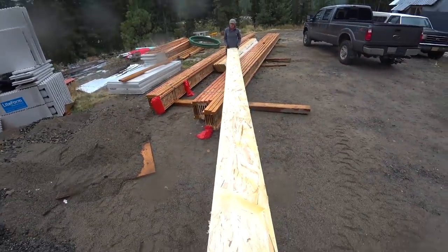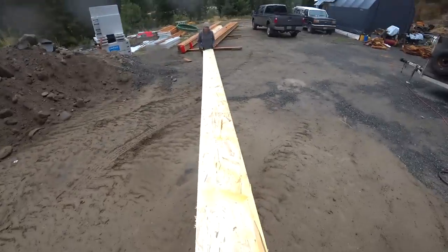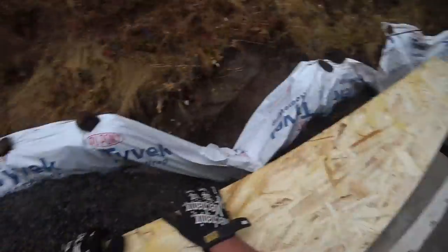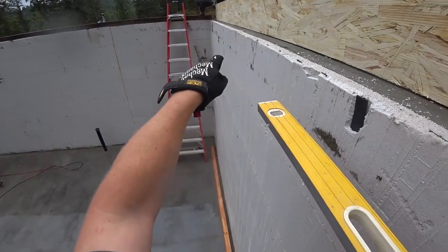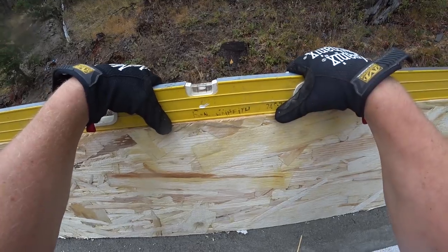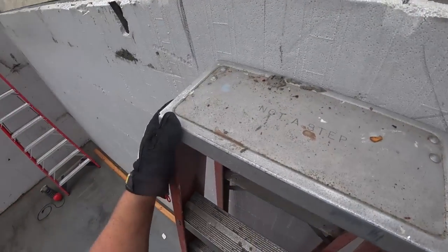What's really hard to tell is the foam is making it nearly impossible to see our high and low spots in the wall. And of course there's both high and low in the length and the width of the wall, which makes it really hard to tell what's going on. It's looking pretty flat, but there's definitely some high spots. I'm sitting on this high spot here and you can tell because of how wobbly this is — it's free spanning all the way to you. So from there to about there.